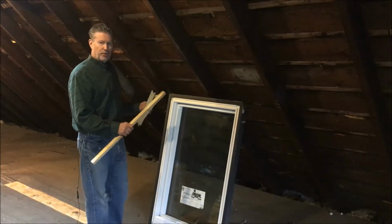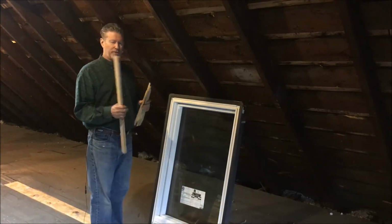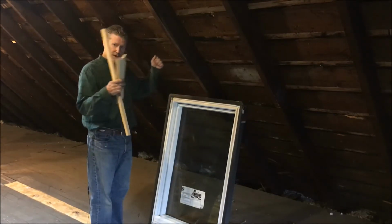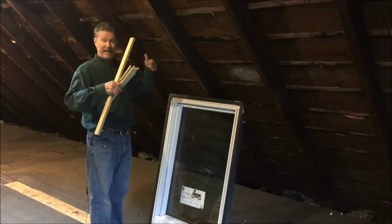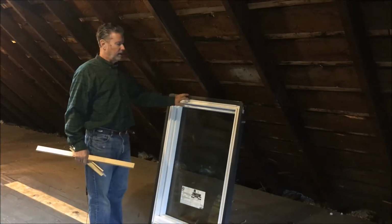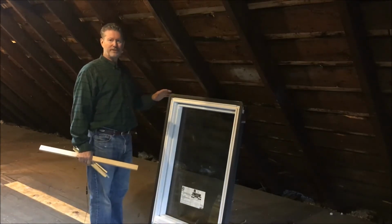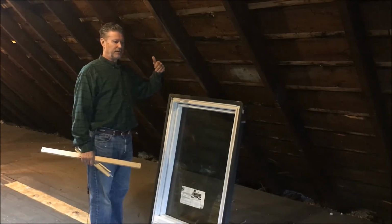So I just think it's important to have that really rigid and to have all of the braces inside the rough opening dimension so that you can fit it, you can get it all nailed down from standing in the frame before you remove these braces, and then you do the rest of the roofing standing on a scaffold, and then you can put the glass back in.